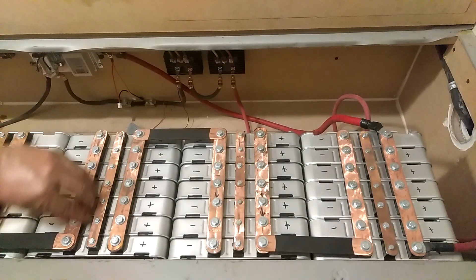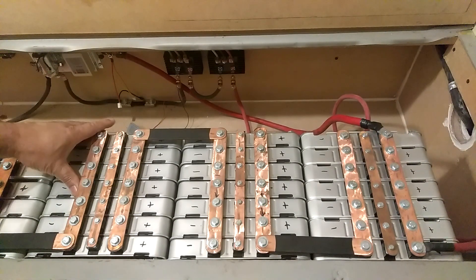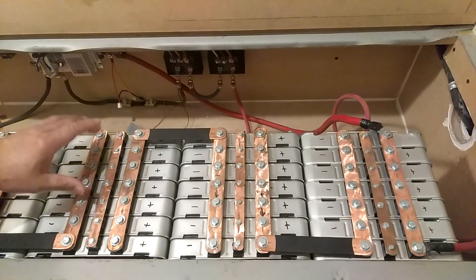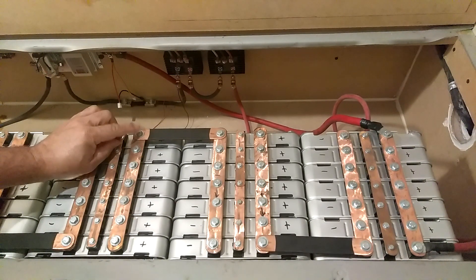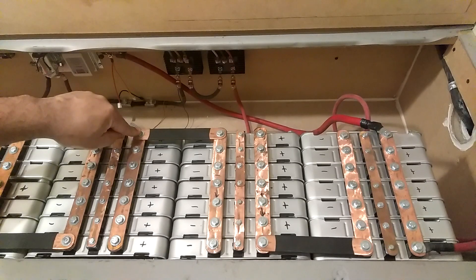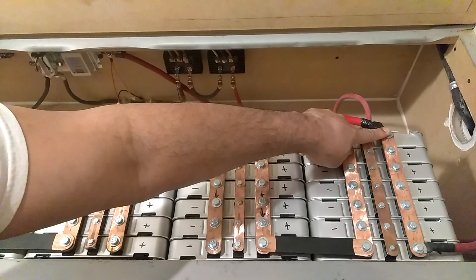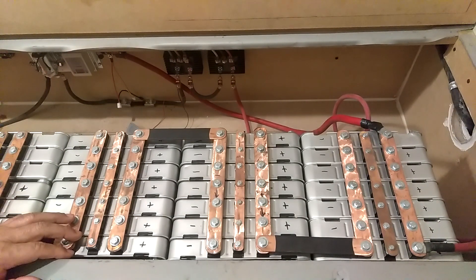What you're going to have to do is build some bus bars. I like using thick wall copper pipe — I get it at Home Depot. Half inch copper water pipe, and make sure it has the blue line on it. The blue line means it's the thick wall. Get the thick wall blue copper pipe, smash it down, drill your holes, make your bus bars. Then you're going to series them together: come off of this plus over to this negative, then off this plus over to this negative. Hook your inverter to this positive and your ground to this negative — that's your whole 24 volt system.